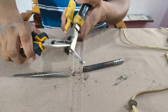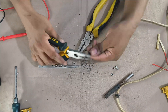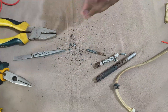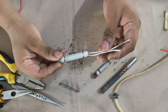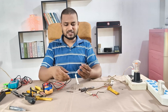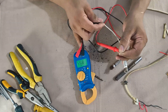Let's remove the damaged coil and tip. Before I install the new one, I'm testing it with the multimeter. Yeah, this one is good — full continuity.